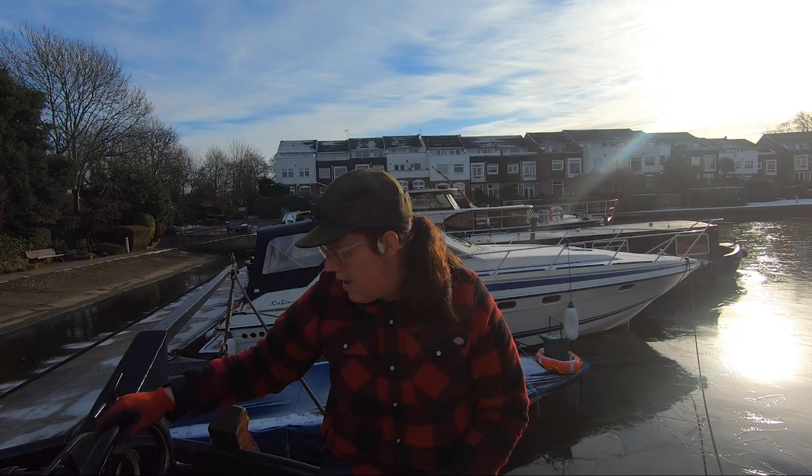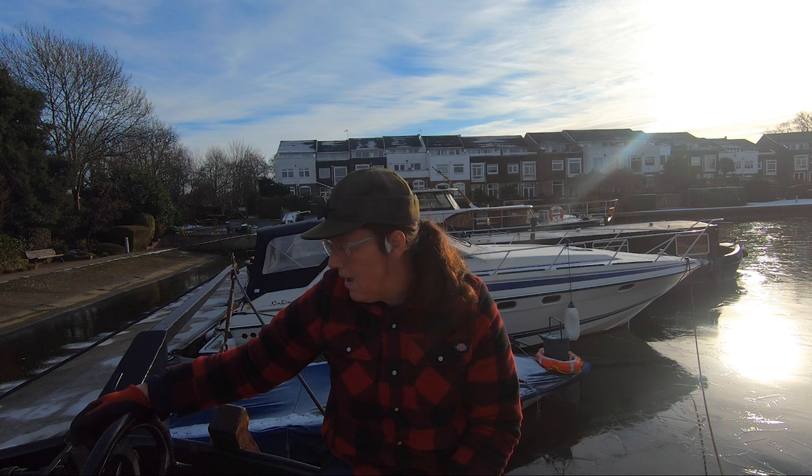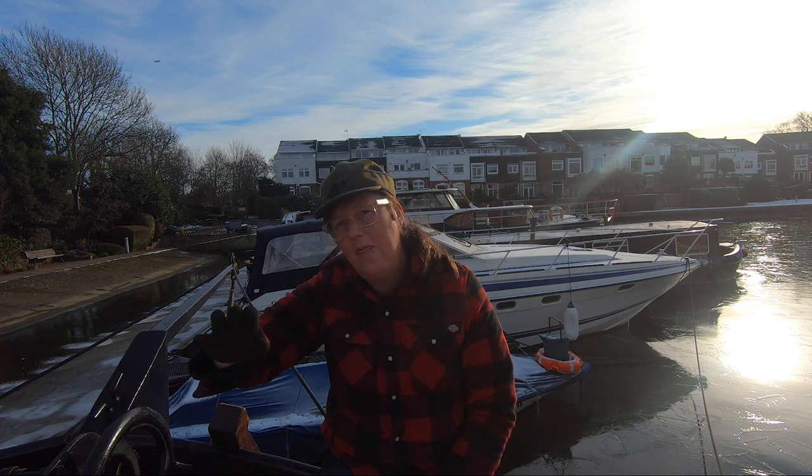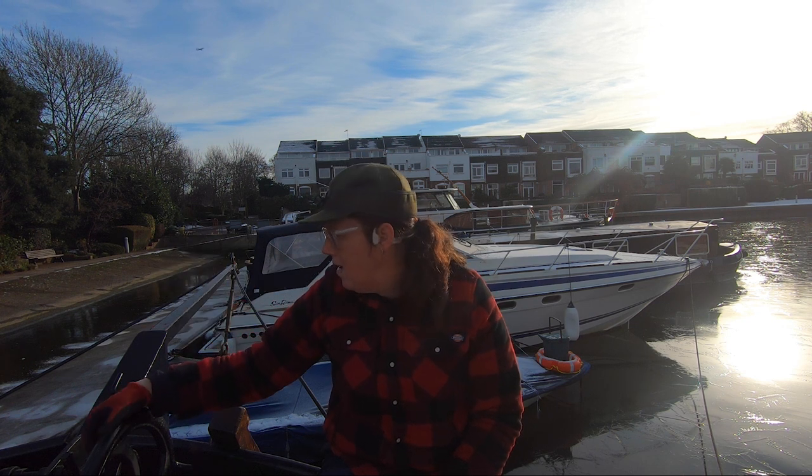So we're back out on deck again, and today I'm going to try and get the mast up. It's a bit of a nerve-wracking time. I've got some friends, neighbours coming to give me a hand, but I just need to check everything a few times. I also need to get a bit of chain for the bowsprit, so I can rig that up with a couple of shackles, so when the forestay comes out I can attach the forestay onto something.